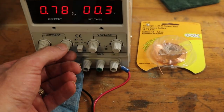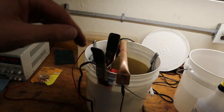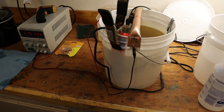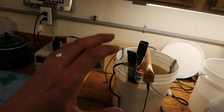At the 10-minute check, I can see it's bright on the edges but a little gray in the middle, so I want to bring the amps up just a bit. As you turn those amps up, that shiny silver will start to appear — that's what you want. This process isn't always perfect. You may have to pull it out, take it to the bench grinder, polish it, and start over or put it back in the acid bath. Just be patient, especially when setting everything up and getting all the components right. That's why I definitely suggest you just buy the kit — it'll save you a lot of headache and time.